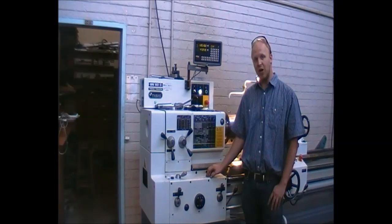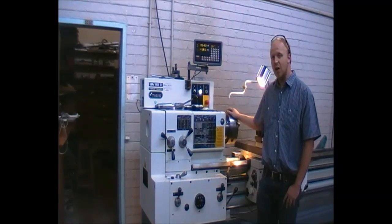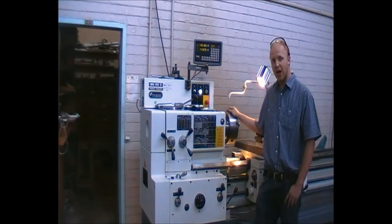Please ensure that your area is clean of any obstacles and nothing is in the way of the rotational chuck. Make sure the coolant is working and the safety switch is working. Please note — shavings coming off are normally long strands, they are definitely able to cut you, and should never be touched by hand but rather by tools which can be asked for from the instructors.